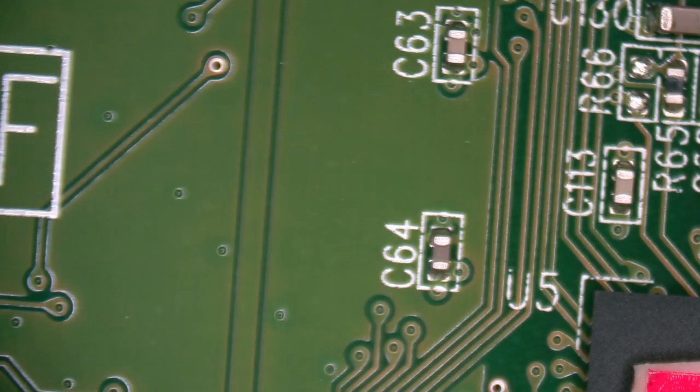Okay. We'll put our dead board next to our dead hard drive. Let that cool down, and we're gonna flip the new drive over and we'll transfer this chip onto there. Now the customer is going to test this. He's going to turn the hard drive on and everything, so I unfortunately will not be plugging this in. So we'll just remove the new board. We'll gently set the new drive over to the side.